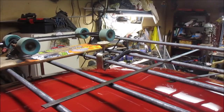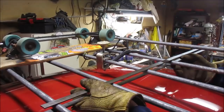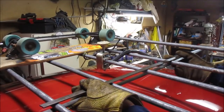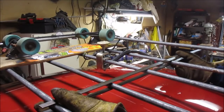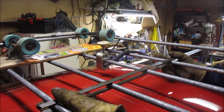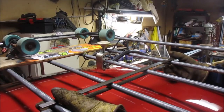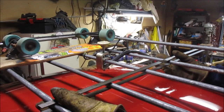I'm going to make it a little more lower profile. I'm actually going to use a couple pieces of flat stock. Where the two meet, we're just going to make a sandwich with some nuts and bolts — probably some wing nuts — nice and easy to get on and off. Instead of using the big clamp, a little lower profile sandwich with this flat stock should be enough to hold the skateboard where it needs to be.